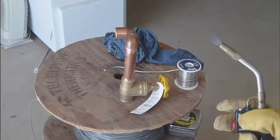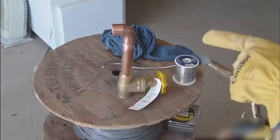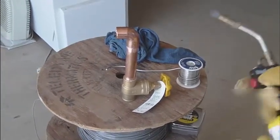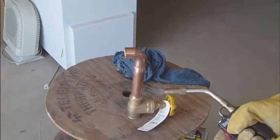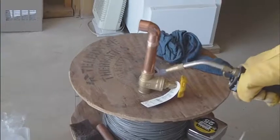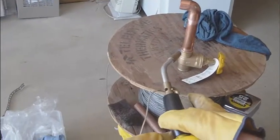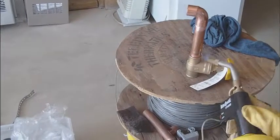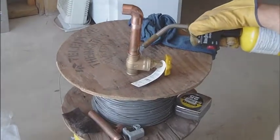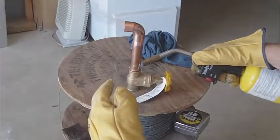I'm going to fire this up. If you can see it, I'll put my hand behind it. There's a cone that comes out to a point, which is going to be very difficult to see in this bright light - ends right there. And then there's an inner cone right there. What I want to do is place this where the end of that flame is. I want to be back a little bit, and then I want to rotate around 360 degrees. Sometimes you might be lucky to reach all 360 degrees; if not, get it as sufficiently hot along all sides as possible.